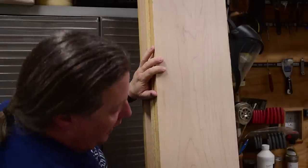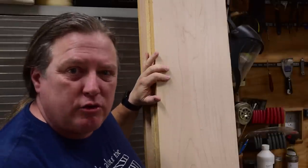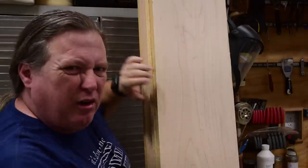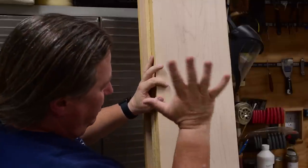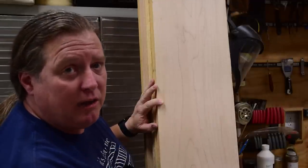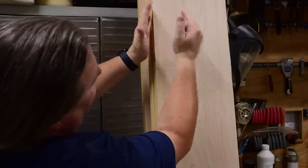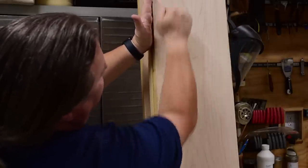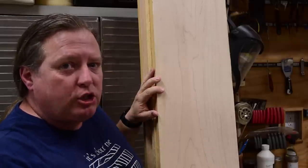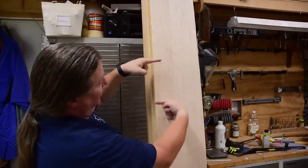When I'm working a furniture piece I like to find boards where the cathedrals, if I'm using a flat-sawn board, are all pointing in the same direction. But notice right here — the grain begins to reverse. This cathedral is pointing up, but right about here it evens out and then the cathedrals start to point down for the rest of the way. For me this would make a horrible tabletop because I work with hand tools a lot, and grain direction means I'll plane perfectly this way but start getting tearout right about here and have to reverse. Plus, for cabinetry, you generally don't want cathedrals fighting each other. By looking at cathedrals, if I come over and catch the side where the grain is nice and even, that tells me I'll probably get tearout if I'm planing one direction versus the other — even with no cathedral, the grain is still moving.